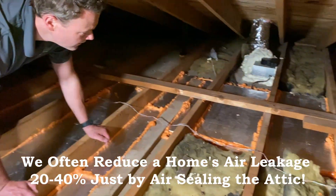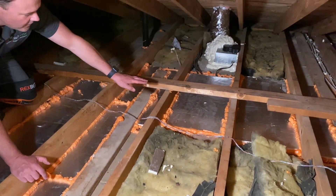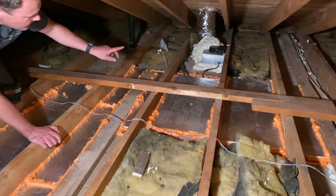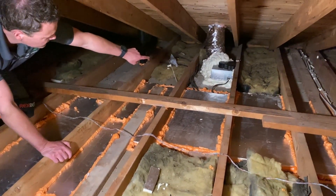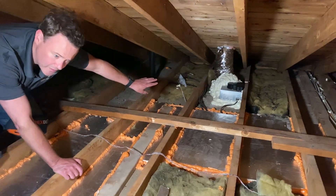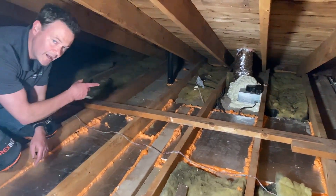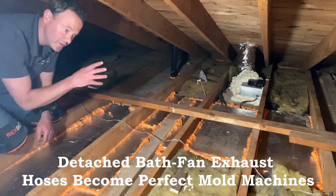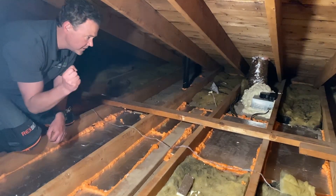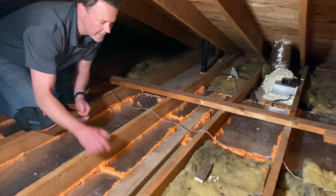This is another bulkhead connected to it that went into another shower with a drop ceiling below and a recessed light in it — again, all we did is cap it with one-inch-thick foam board and seal around the perimeter with foam. Down here is the bathroom fan, vented outside through the roof. The foam on it might look weird to the untrained eye, but we do that to prevent any risk of the exhaust hose becoming detached from the fan — because when we get up in these attics, we see the exhaust hose become detached all the time. At that point, you've got warm steamy air venting directly into the attic, which often causes a mold problem.